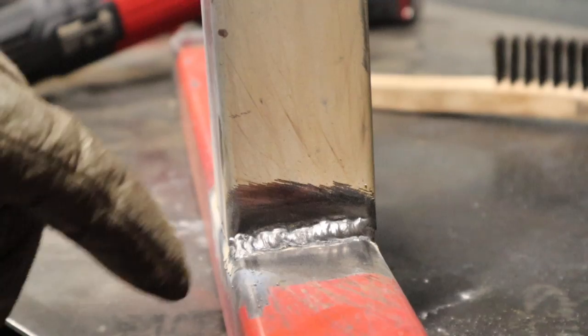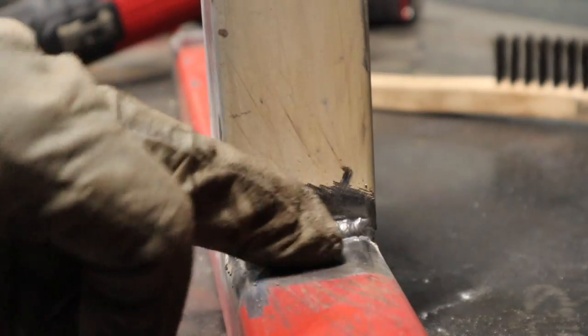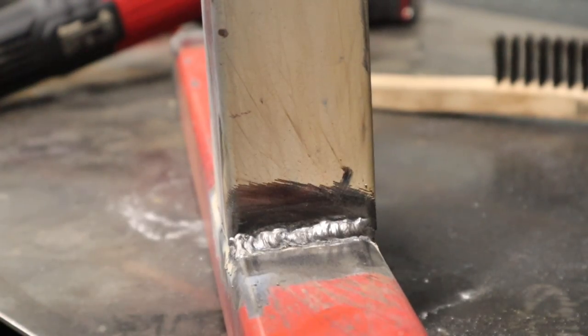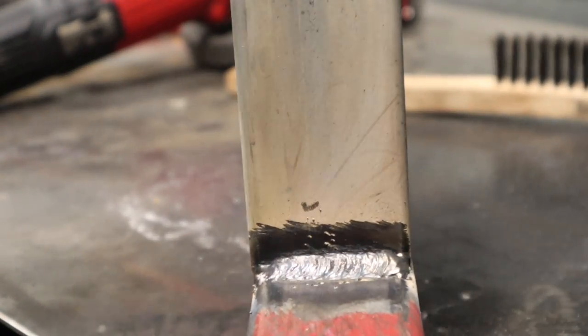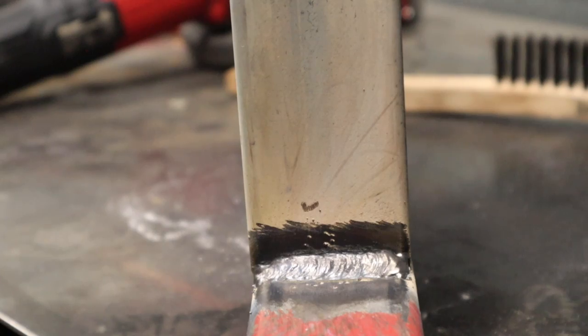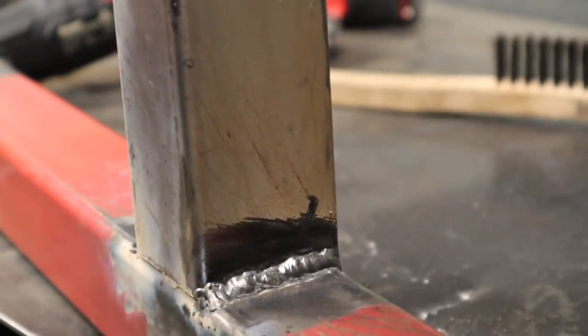This is why the Yes Welder Flux 135 needs to have the dials labeled and then have a little chart to refer to. This is my first weld. Pretty bad. I honestly should have stopped and made adjustments. This is my second weld. Much better. Probably could adjust it a little bit more. With this first weld, I think I may just grind it out and totally redo it.